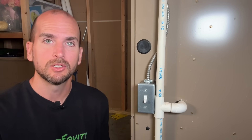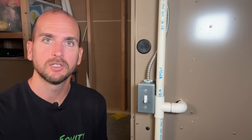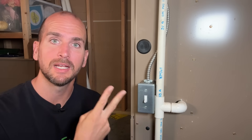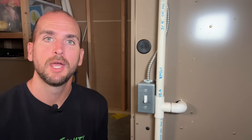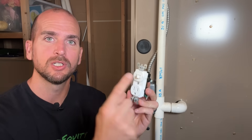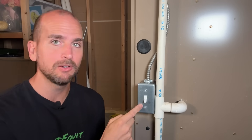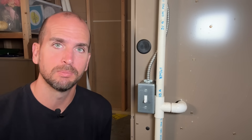If you just needed a power disconnect switch, you're good to go. You can now easily service the unit — flip it off to change your filter — and you're both meeting code and adding a real convenience factor.